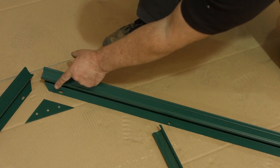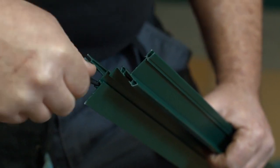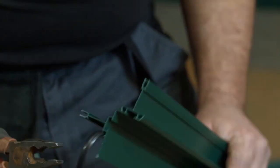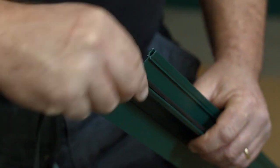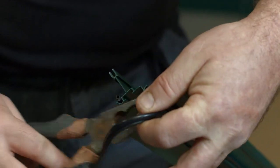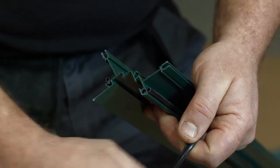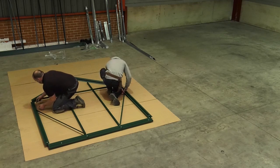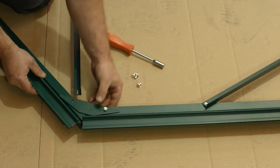The letter R is covered on powder-coated models, so the center hole in the roof corner bar should be positioned so that it is nearer the ridge than the eaves. You're viewing the assembly from the inside. Slide glazing beading into both beading channels of each glazing bar and into two of the three beading grooves in all four corner bars. The middle groove is only used if you have an internal partition. Secure the eaves and ridge gusset plates to each corner bar as shown, by inserting bolts into the hole in the corner bar and then in turn the gusset plate. Don't put the nut on the top bolt of the gusset plate until the horizontal brace is fitted.